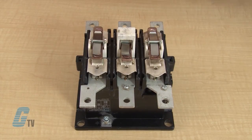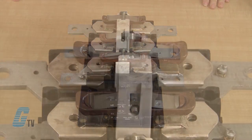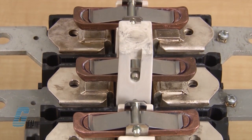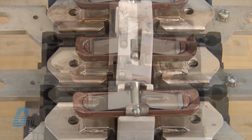I can then take off the front cover and see my contacts within the contactor. The moveable contacts are held in place by a metal peg. On the moveable contact is a contact plate that is flexible and has an indentation resting under the peg.